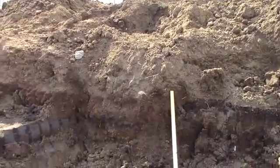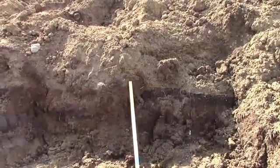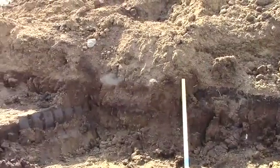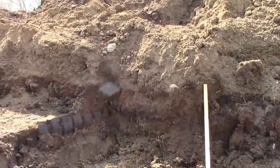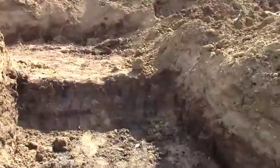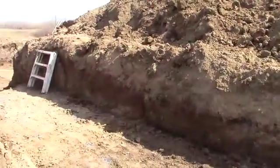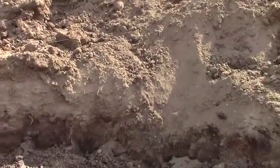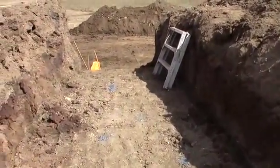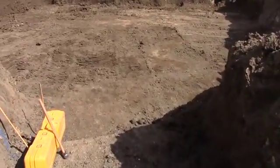Working up towards garage height, you can follow the grade — it's rough for now. Stretching these steps out allows us to get a more gradual grade drop from the front of the garage all the way around the side and back to the walkout. If you close the steps up too tightly you end up with more of a steep cliff. Here's the last step, and this is the front of the garage — when we're all said and done this will need a little bit of backfill to get us four feet below frost. You can see the house ahead, and we come back down three steps of 18 inches.